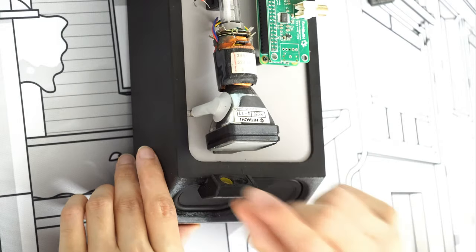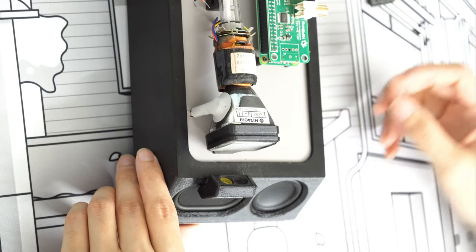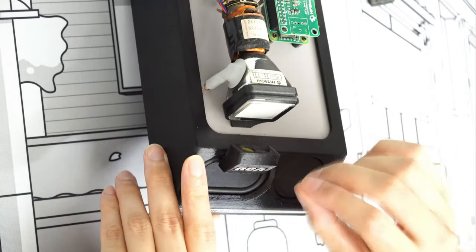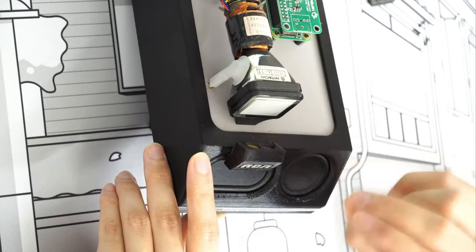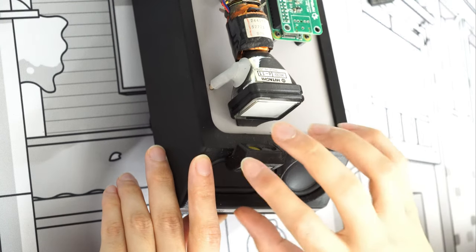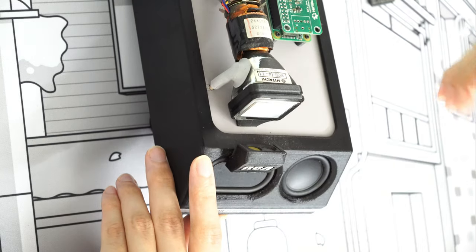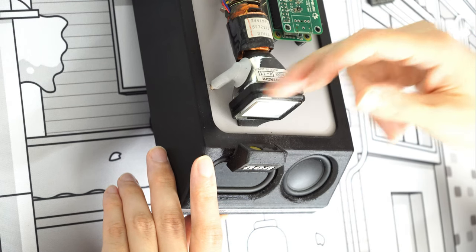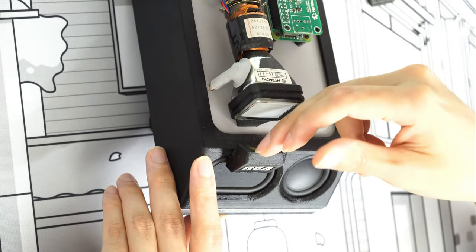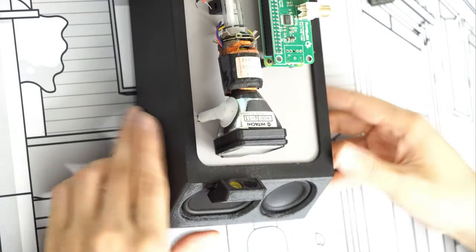The nice thing with this type of tube here is, if you take a magnet in front of it, for a standard Trinitron or a shadow mask CRT, if you take a magnet close to the screen, it's gonna distort the colors completely. But with this one, if you take a magnet nearby, it's obviously gonna distort the linearity of the picture, but it's not gonna change the colors, because the way the beam scans, it's always gonna hit green, and this is gonna detect that it's green, if that makes sense. So yeah, this is very, very special.